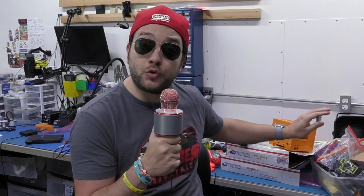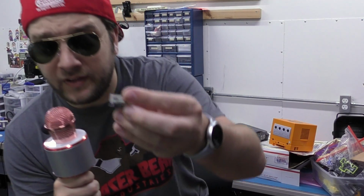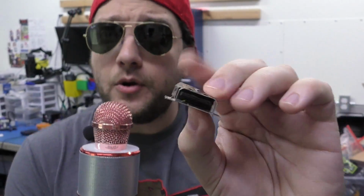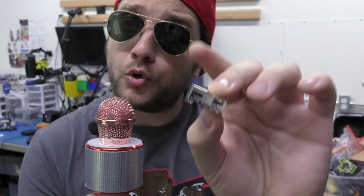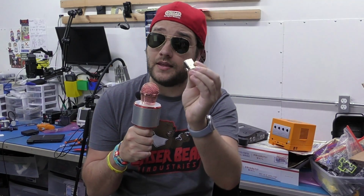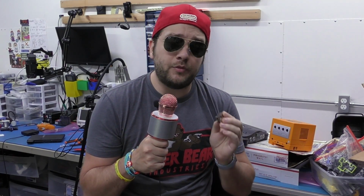Another problem is people on the internet have made video tutorials of removing the digital video port. Now this video port is not being made anymore. We should be preserving these. And the tutorials that I've seen, oh my God, they have people using hot air on a through-hole component like this with helpers such as Chip Quick.